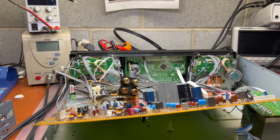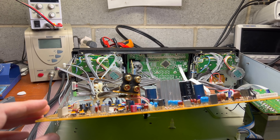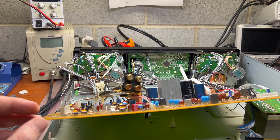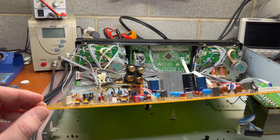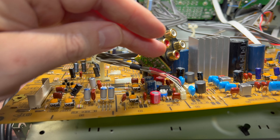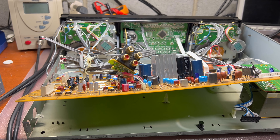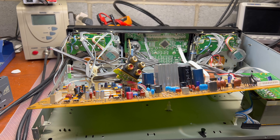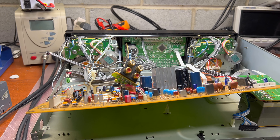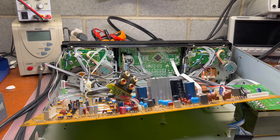Now when I play it back I can quickly see the frequency response of any deck. Comparing to my 555ESJ, this deck was a little bit dull, so I decided to replace all pass-through capacitors with solid polymer. It became better, but high frequencies were still not in place — after 10 kilohertz there was a significant roll-off.